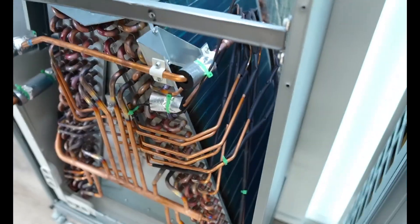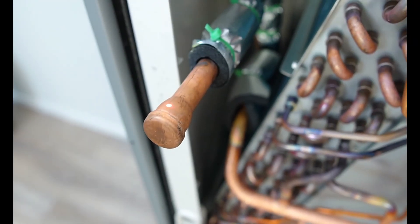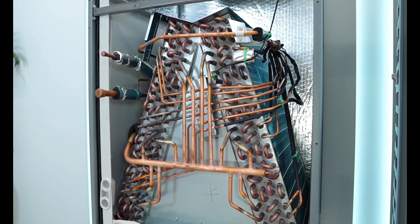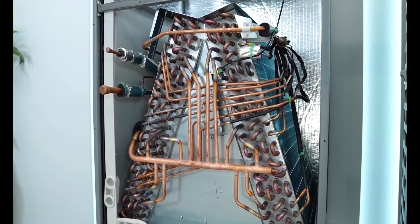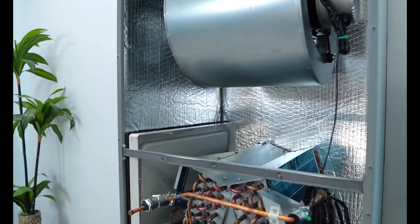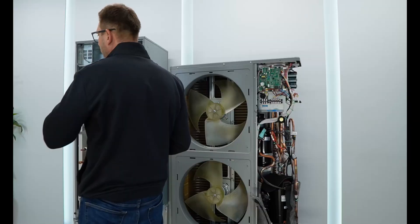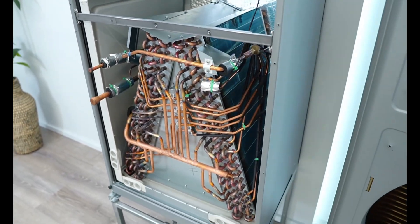We've got an oxidized coil — pretty good. Now, these are not corrugated coil fins, just conventional. Look at this suction line — it only requires three-quarter inch copper on a 4-ton unit, while most require at least seven-eighths inch. The coil is impressive in size, similar designs to Trane. Larger coil is better. There is one drawback: they used copper. We'd prefer aluminum — too many leaks on copper coils. That said, manufacturers are going to upgrade to aluminum eventually. It's not a deal killer to have copper coils, but aluminum is a little better.